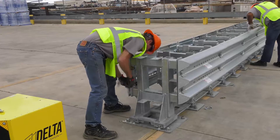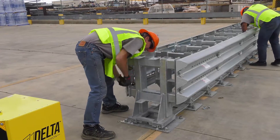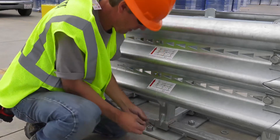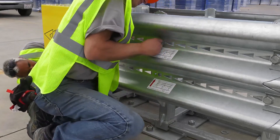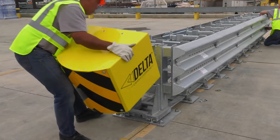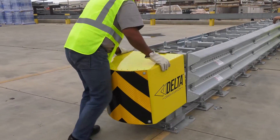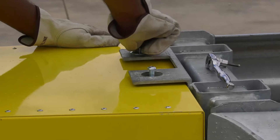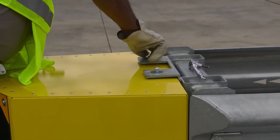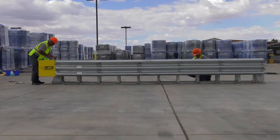Secure all bolts. After all the panels are attached, install all sacrificial bolts at alternating diaphragms. There are ten sacrificial bolts used on each side. Install the nose piece by lifting into position and inserting two bolts on the top and two on the bottom. Finger tight the two top and bottom bolts. Tighten all winged washer nuts and sacrificial nuts.